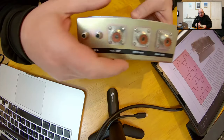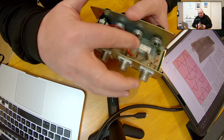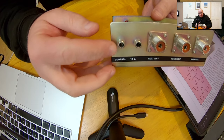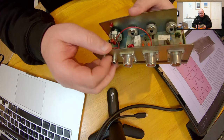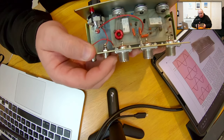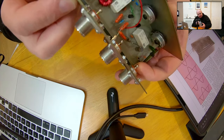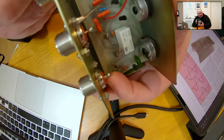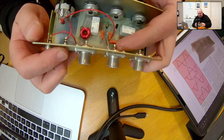On the back you've also got a 12-volt power supply input, which it needs to kick the relays over to the receive position, and a control port. This will tolerate about 200 watts, although it may be a little wimpy for that. It looks like there's lightning protection inside — there are some very strange folded-back bits of wire in there. You can just see underneath — there's three of them, all done the same way. They look like spark arresters.